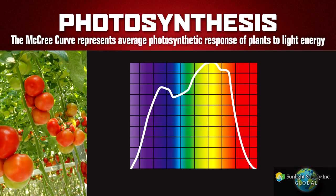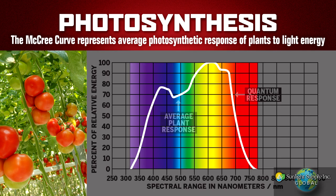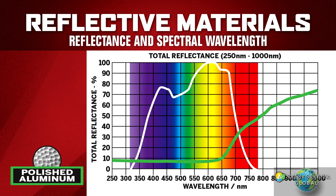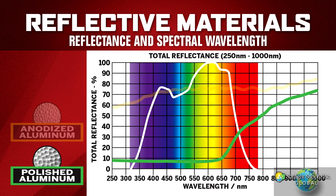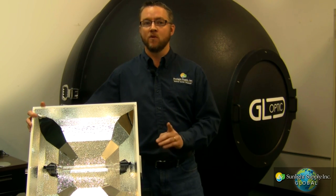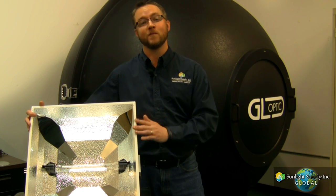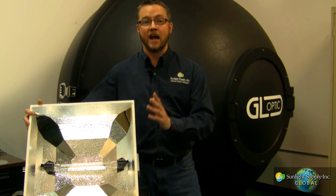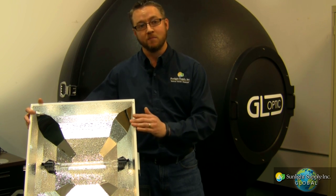Now it's not just the reflective percentages that we're concerned with. We must look at the spectral wavelength the reflectivity is happening at. As you see on this chart, the low-grade Chinese oxide material has very poor reflective properties in certain spectral ranges. The anodized aluminum material has a wavy, inconsistent pattern with peaks and valleys across the spectral wavelengths. Then we have the PVD material with a very even reflectance across the full spectral range. Ideally, an even and uniform reflectivity scale with regards to the nanometer wavelength is what we're after. When I refer to reflectance, it's important to note that if the light is not reflected, its energy is absorbed in the form of heat. So a lower reflectance hood will absorb and then radiate more heat into your growing environment than a highly efficient, highly reflective hood that will direct more light onto your target garden.